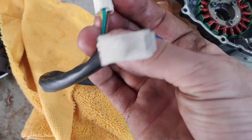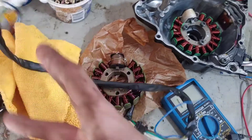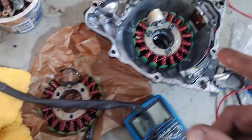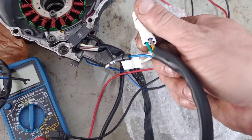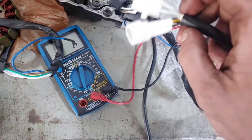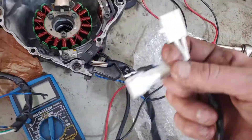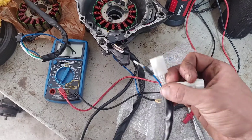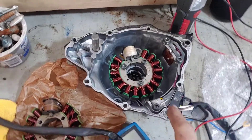Overall, you'll want to set your meter on 2,000 ohms, and you should get readings between all these wires — yellow and brown, yellow and green — you should get readings. This stator that was in the bike was not giving us any readings; it's broken inside. The new one, however, I've been able to test and I get ohm readings between all these wires. I'm going to list in the comments what you should see between these wires on a new stator.